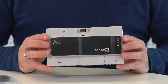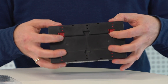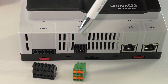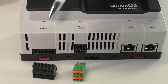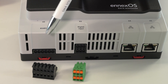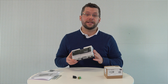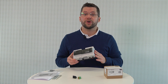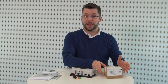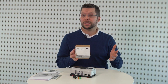You can easily mount the Data Manager on a DIN rail, or alternatively use the mounting brackets on the wall. This is the plug for digital inputs for active power limitation. And this is the plug for future supported Modbus devices with RS-485 communication. The Data Manager is delivered without a power supply unit, which means that you have to obtain one that complies with the specifications. For example, you can use the power supply unit for a cluster controller, an inverter manager, or the SMA web box.